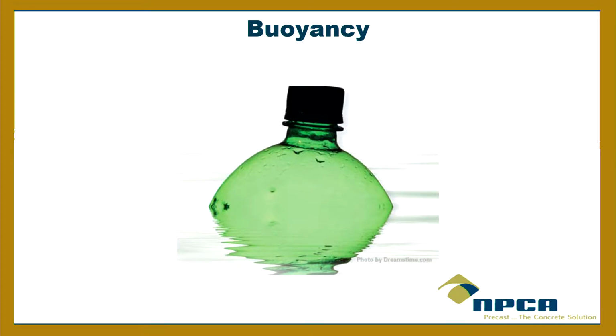Talking about buoyancy for a moment, I believe the rules do address making sure that the tank doesn't float or move due to high water table conditions. Concrete tanks can float. That has happened. It's harder to do because you're talking about very heavy material, but it can happen. So it's incumbent upon the designer to make sure that the tank is designed to withstand those buoyant forces, if buoyancy issues could arise in that area, if the water table could come up.